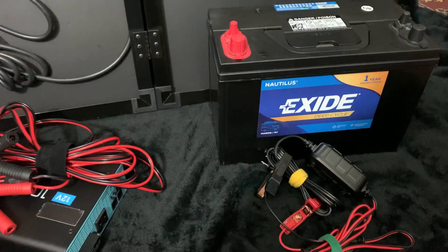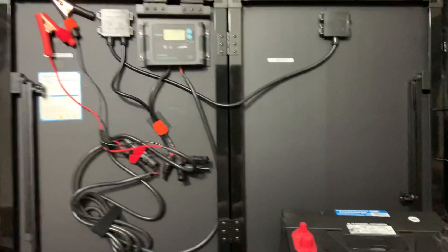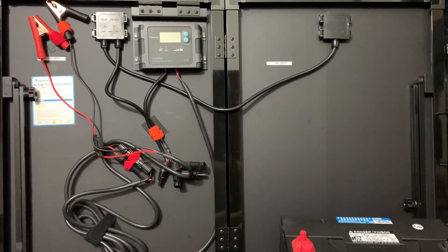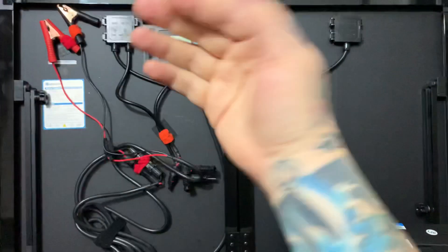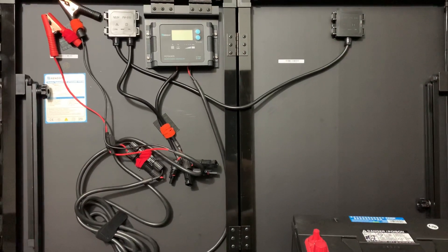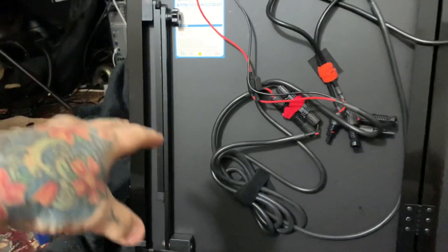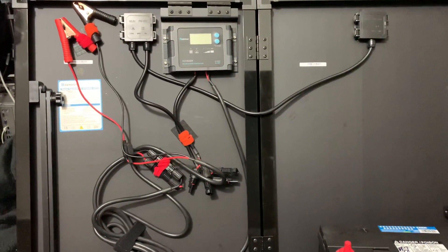I'm upgrading to a 200-watt panel for my cabin rig. The 200-watt is about 30% smaller and weighs half as much, but it's more fragile. These 100-watt monocrystalline panels are a lot tougher because they're encased in glass at the front. They weigh a lot more, but whether it's a Renogy or Goal Zero, they all come with nice kickstand legs that let you angle the panel to the correct incident sunlight angle. Thanks for watching.